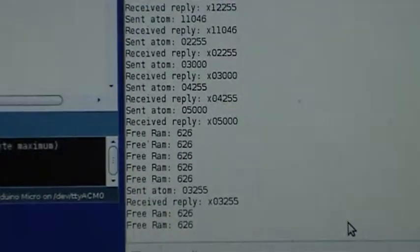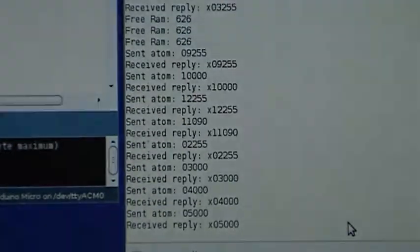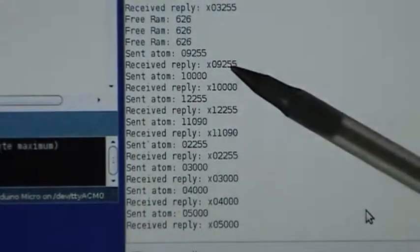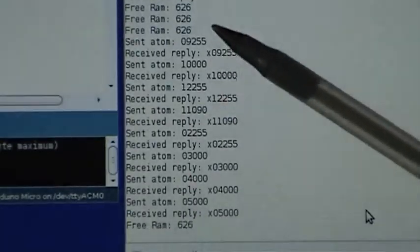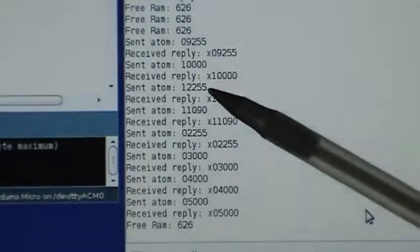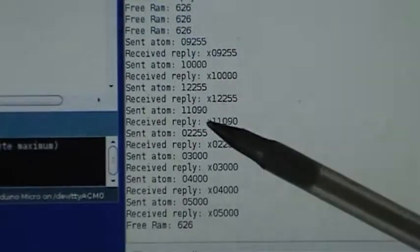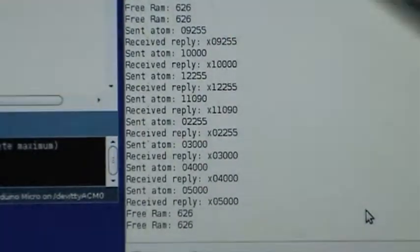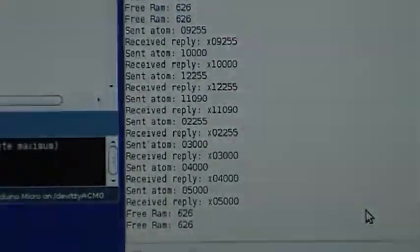However, if we do a full preset cycle, we see a lot of commands go through. Each one represents something different. We sent the 9255, which happens to be one of the volume commands. There are 3 volume commands, a tone command, then the neck, middle, and bridge, and then the bridge split command. Those were all sent appropriately. You can see there aren't very many things sent.